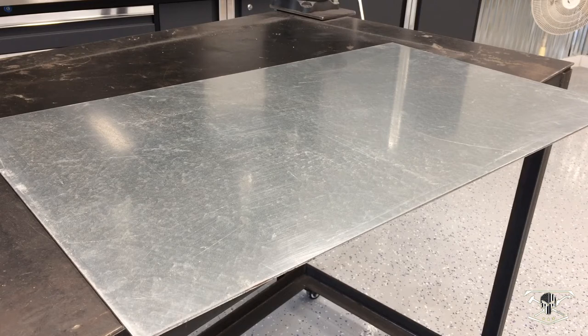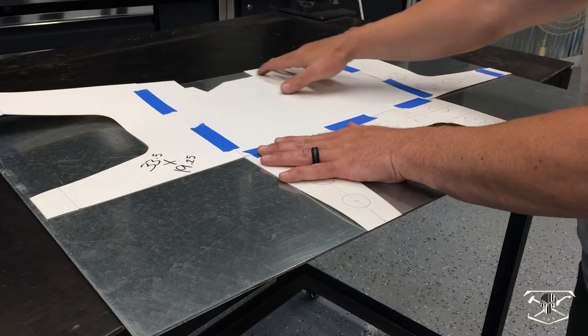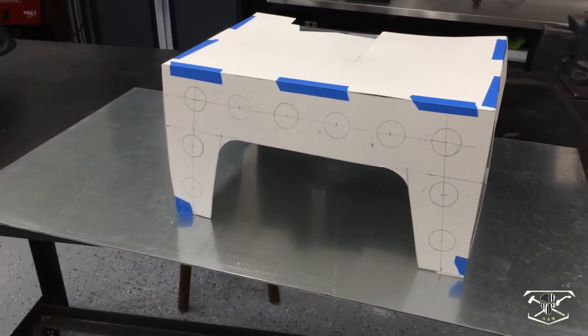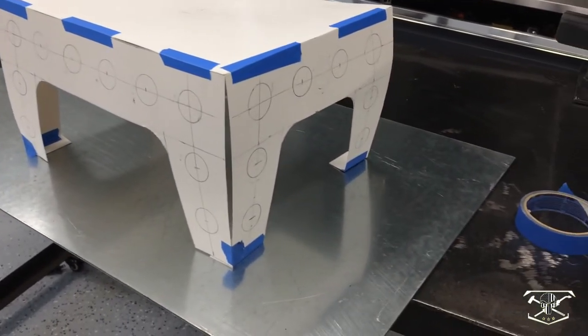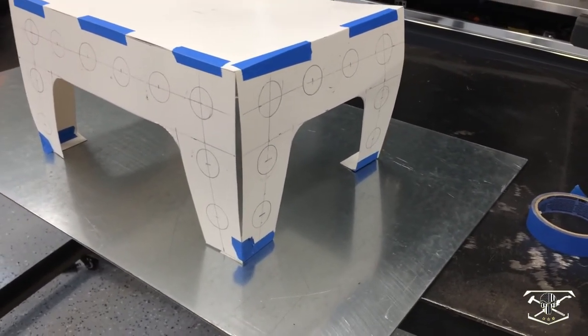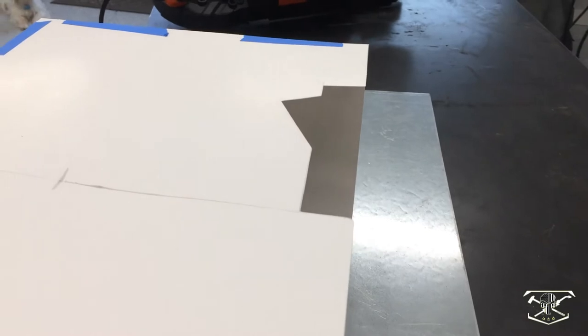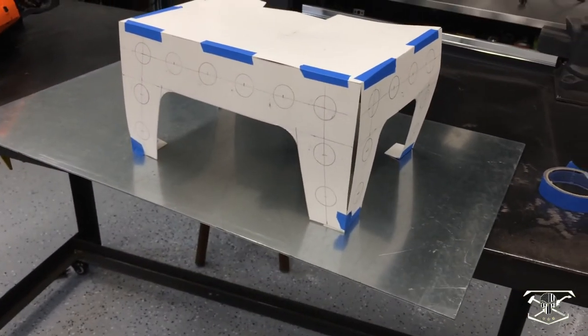Being this is the material I have to work with, I came up with a cardboard template. The template is going to use the entire sheet of steel, which is also galvanized to help with durability — so I don't have to paint it. There will be three sides with legs, feet bent in on the corners, provisions for some dimple dies for personality, a relief for the machine to fit in, a groove for the belt, and mounting provisions.